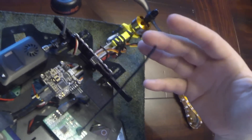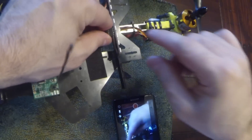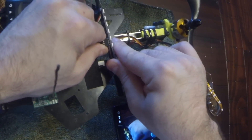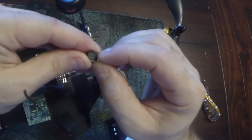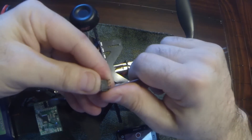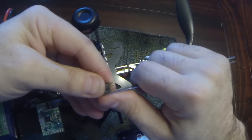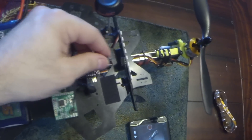I just upload the Arduino sketch on there, and then it's hot glued in place and soldered up into a socket. If I want to program another light pattern, I just pull the chip. They're only about $1.50 a piece. I've bent the leads on the chip, but if I don't break the lead off it'll be alright. These chips are only like $1.50 or a couple bucks, so you don't have to be too careful with them.